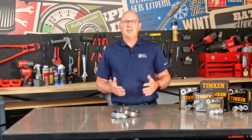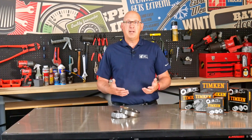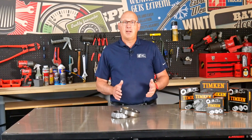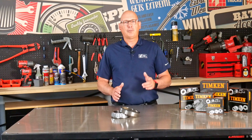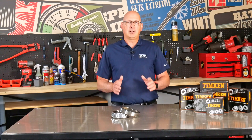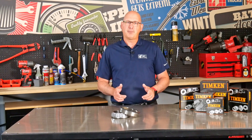And let's not forget about the cost-saving benefits. The cost of matched parts is small compared to the expense of unscheduled downtime — it's a necessary investment that can prevent major headaches and expenses down the line. So whether you're a seasoned mechanic or a backyard mechanic, remember this golden rule: always replace the bearing cone and bearing cup together, and make sure they're from the same manufacturer.